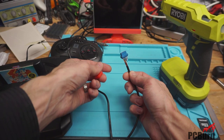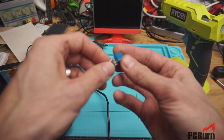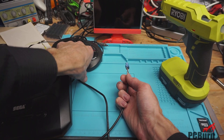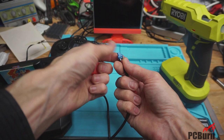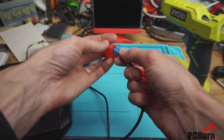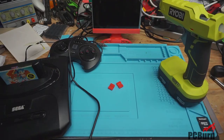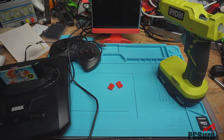But I'm still left with a problem where this doesn't exactly make a great connection. What I did was strip out one of the connectors from a nine pin female jack — I stripped off all the metal and soldered down the connections. Now I need to provide some kind of housing for it, so I built a 3D model of the housing. I'm intending to press fit this in there, fill it with hot glue, and clamp these onto the end to provide strain relief. Let's see if that works — I've got the Genesis over here to try it out.